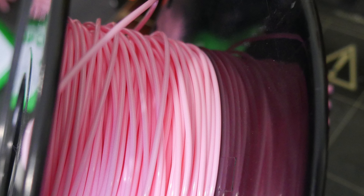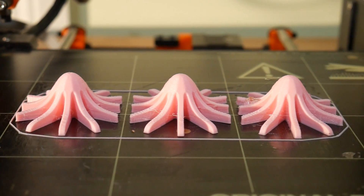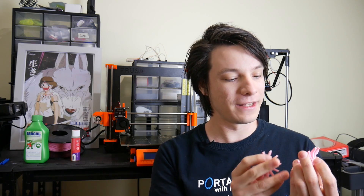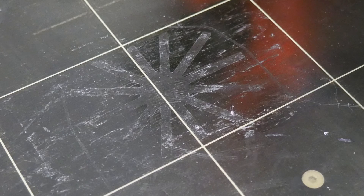So I flipped the machine around and printed exactly the same again without reapplying the materials. We did get a filament jam, which caused some material to squirt onto the Magigoo sample. But again, the middle print with nothing did warp yet again, maybe a little bit worse. The glue stick and Magigoo ones were almost identical side by side, except there was an arm in the glue stick area that warped more than previously — it must have pulled away the remaining glue, implying you're better off applying surface adhesion every time for ABS prints rather than just doing it once.